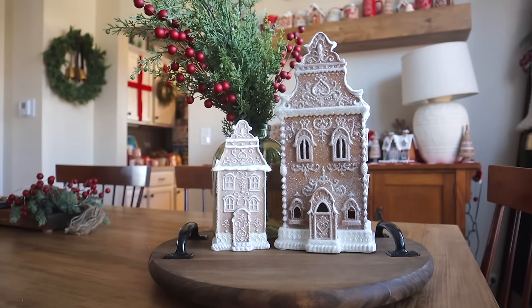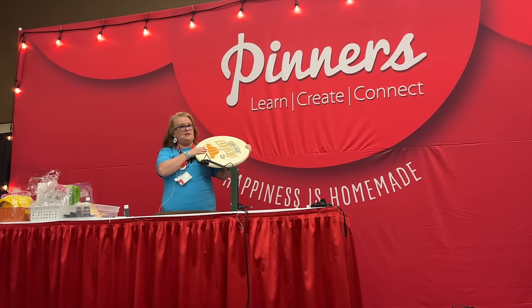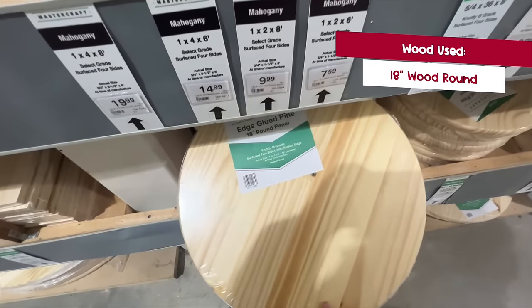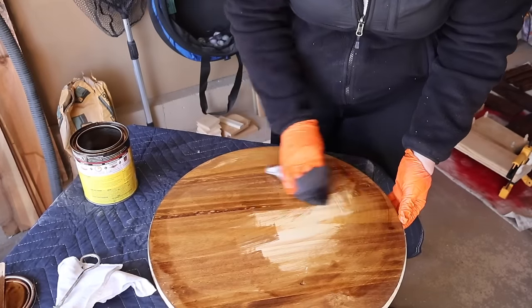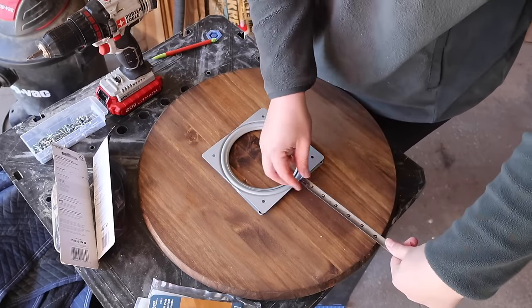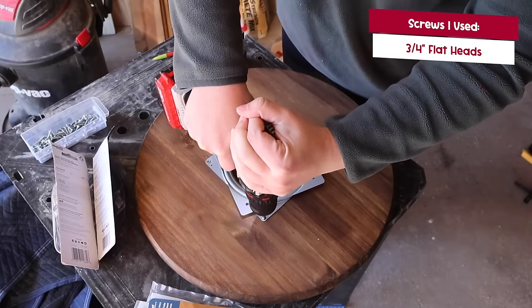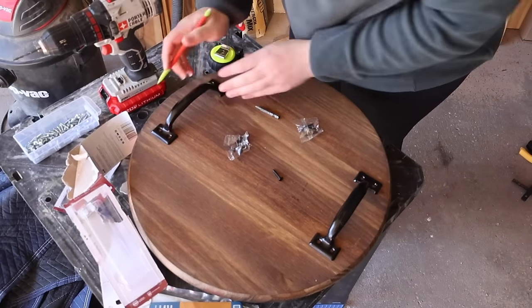Something else I like to do around Christmas is stay connected with friends and family, and that really helps me enjoy the season. This next project is inspired by my friend Courtney over at Creative on the Cheap — she mentioned at our Pinners event that you could take an 18-inch wood round, a 6-inch Lazy Susan, and some felt pads to make a really pretty Lazy Susan. I decided to make a hybrid between a Lazy Susan and a tray. I started by staining my wood round from Menards to match my house, then centered the 6-inch hardware on the board and used 3/4-inch flathead screws to attach it, making sure the screws sat flush so they didn't impede the Lazy Susan. Then I added my felt pads last so they didn't pick up gunk from my garage work table.